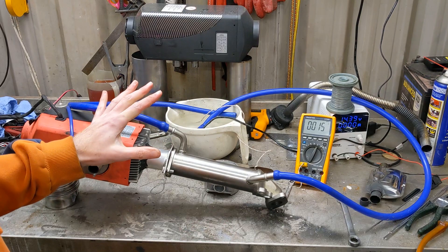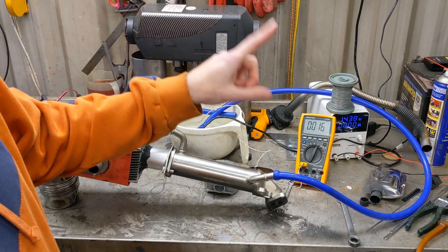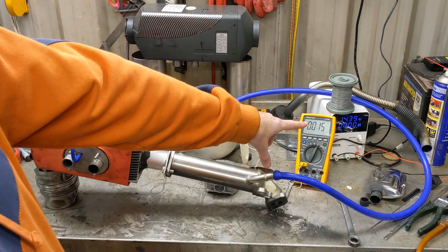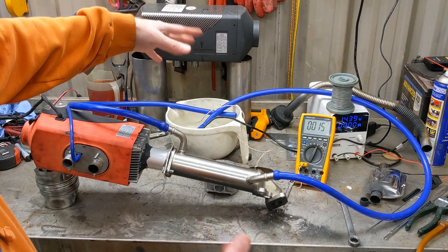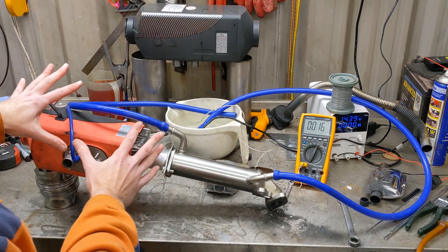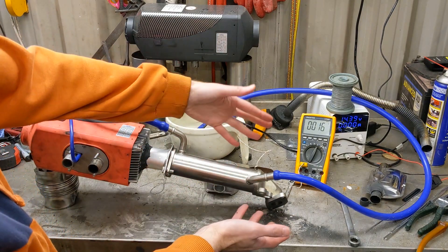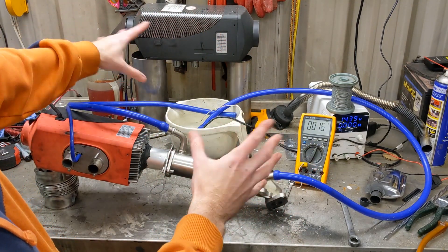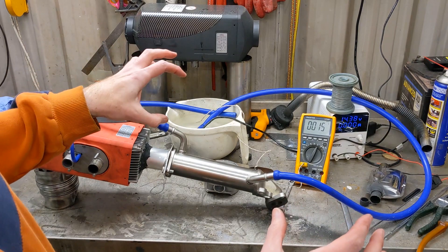Today for this experiment I'm going to run the output of the two kilowatt heater straight through the EGR and we're going to measure the time it takes to heat up two liters of water by ten degrees. I've got one liter of diesel in there and we'll see how much is left, so we can work out the energy absorption capability of the EGR — basically how much energy it can reclaim into hot water and how much fuel it took to do it. I'll pause the video, get it all up and running, and bring you back once it's lit and going.